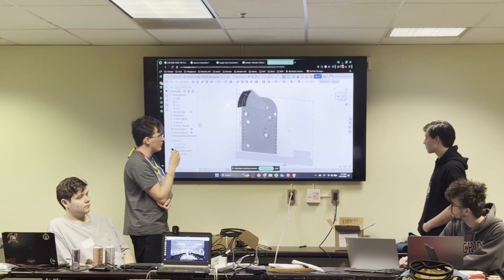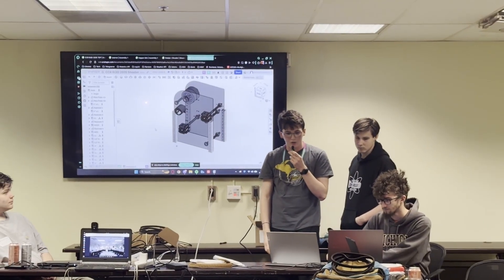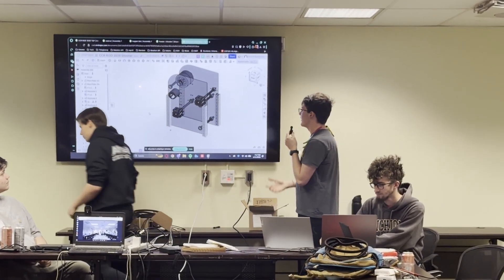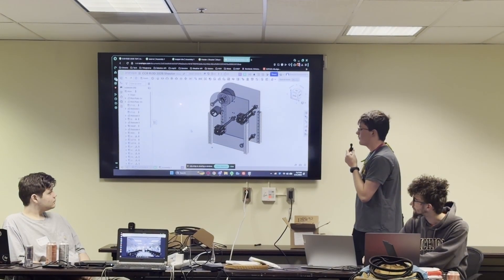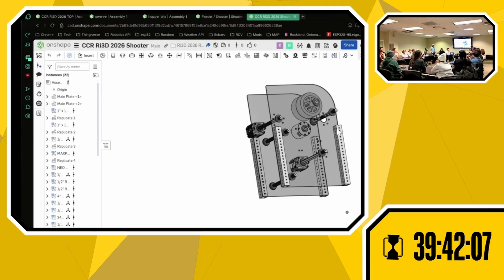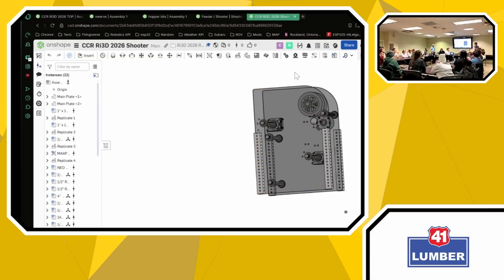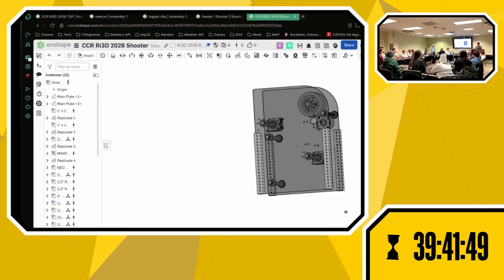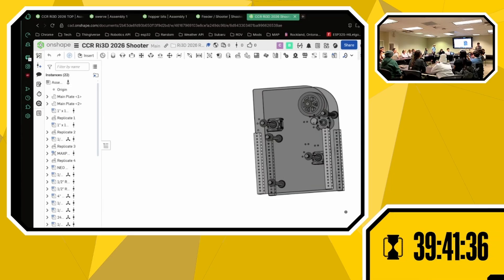This is a design I came up with that would theoretically be much better. Originally we wanted a much taller shooter to be able to shoot over our funnel, but we just don't have the capabilities to make it in this timeframe. This design is more complex since it allows more kicker wheels — one here, here, and going up with belts — to put balls into the shooter. The calculated range for this one was about 25 degrees from flat, which should give well enough range to shoot as far as possible. But this is a design we can't do because of Robot in Three Days.